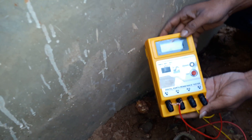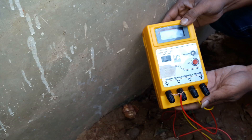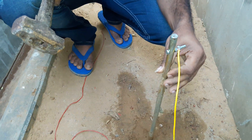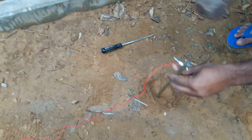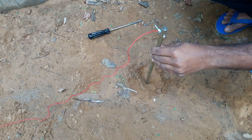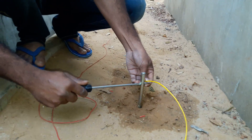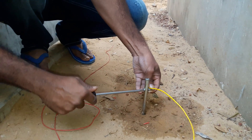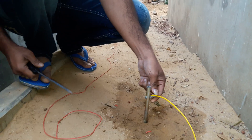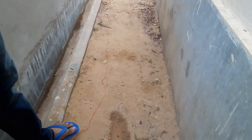Now make ready for test. First, put 2 rods to the left and right — 30 meters and 50 meters distance from the earth pit. This is the earth rod with the yellow wire at 30 meter distance. This is the second rod from the earth pit at 50 meter distance with the red wire. As we have not enough space, we have put these 2 rods in one direction, but you must put these rods in the opposite direction — left and right. The red one is 50 meter distance and the yellow one is 30 meter distance.